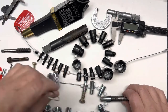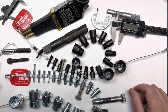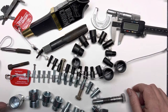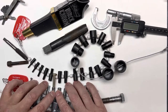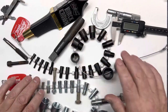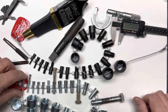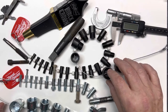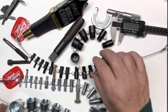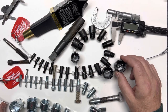It's a 32-inch stringer that you can hang up. There are 23 different sizes on the standard and 21 on the metric. Standard goes from number 6-40 all the way to 1-inch number 8, and the metric goes from M3 0.5 all the way up to just under an inch.